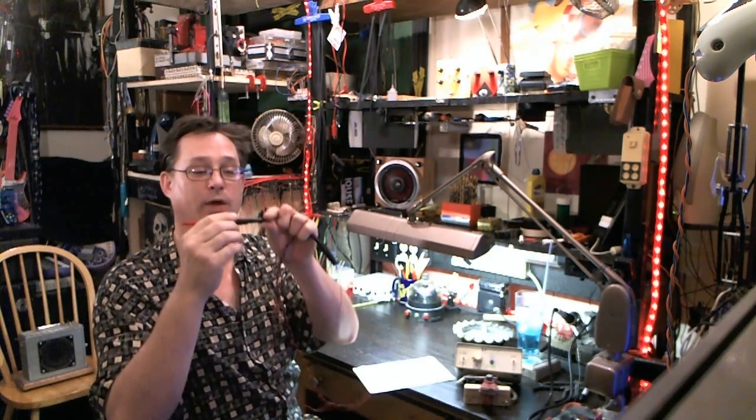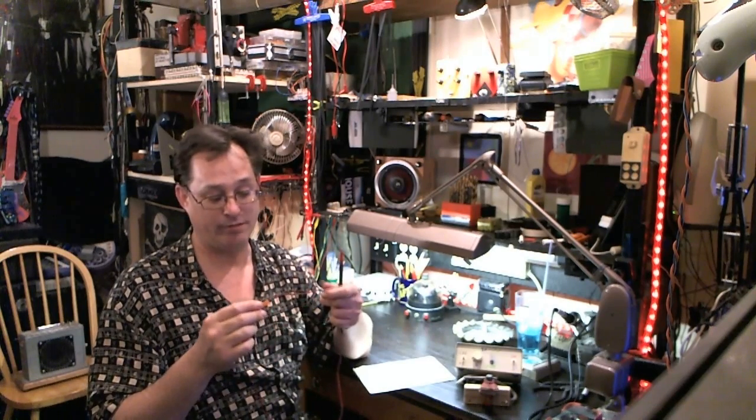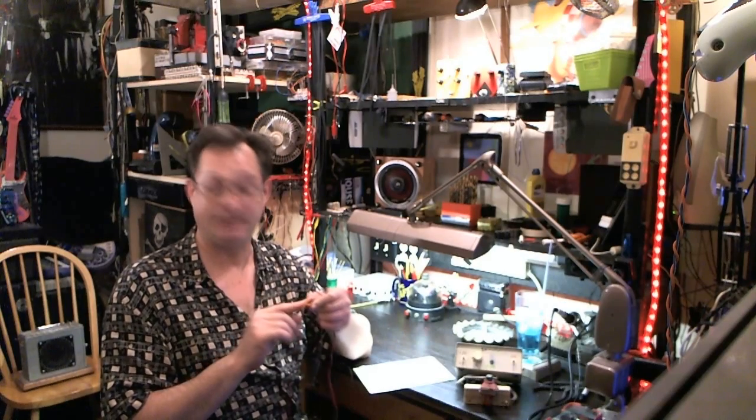You can make up your own mind. When I first built this, I had a non-polarized 1uF electrolytic-looking capacitor — a non-polarized one — and the leads came out of the ends. For my layout design it made more sense to use one that had the wires coming out of the end and hide it inside the pen, so that's what I did. When I tested the circuit with the 1uF value, the volume drop through the capacitor was immense — it was really quiet. So I cut it out of there and put in a 0.1uF non-polarized greeny capacitor, and that worked a lot better. There isn't much of a volume drop, as you'll be able to hear later. I would recommend you go with a mylar 0.1uF capacitor if you're going to put one of these together.